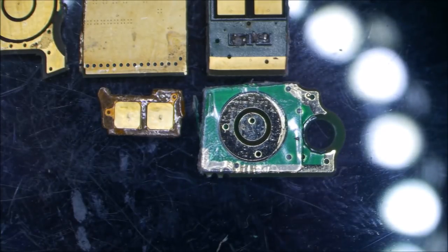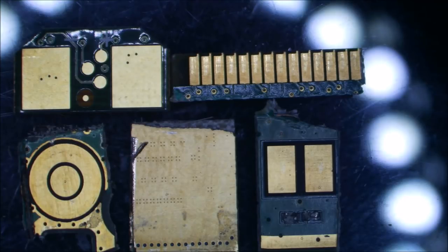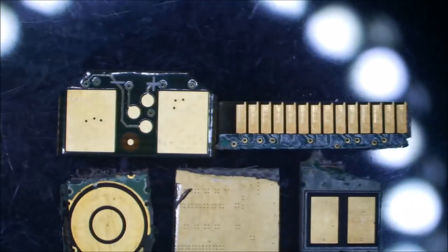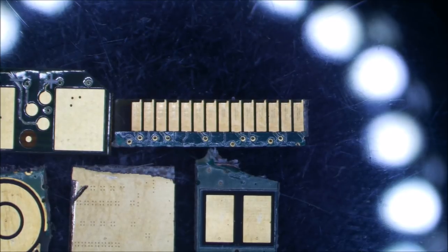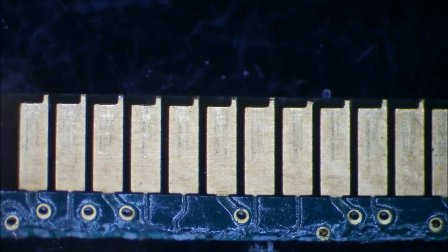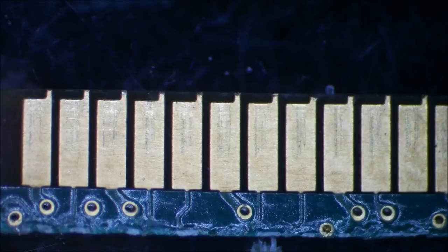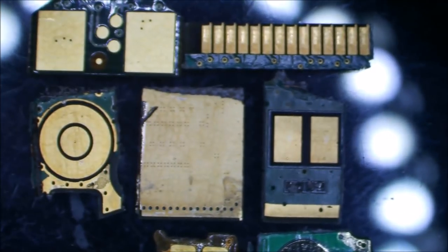The top SageM sample is likely going to be ENIG because it's on a board that has a lot of stuff soldered to it. The bottom one - if I move it a bit you can see it is gold colored - but I suspect the gold might be treated with some other metals to make it harder wearing, so we'll see what it does with the nitric acid. Up top we've got our control samples: the known ENIG board on the left, and some well-worn RAM fingers which we're pretty sure are hard gold.